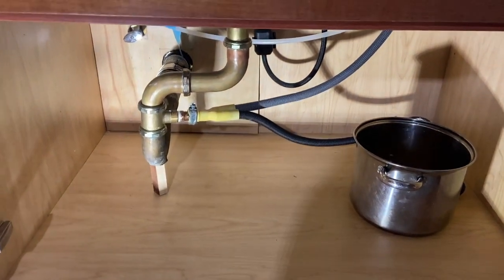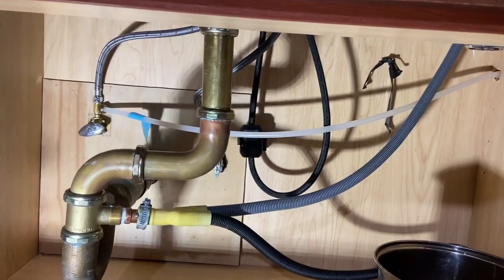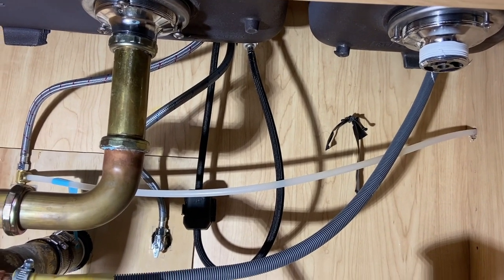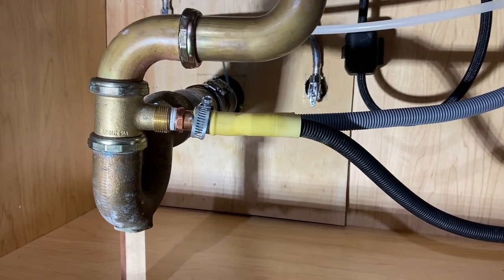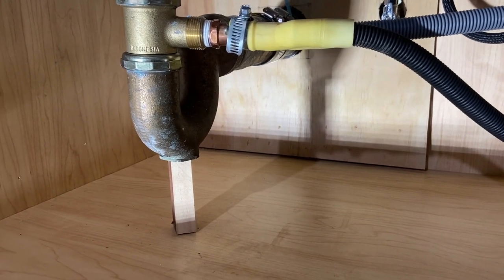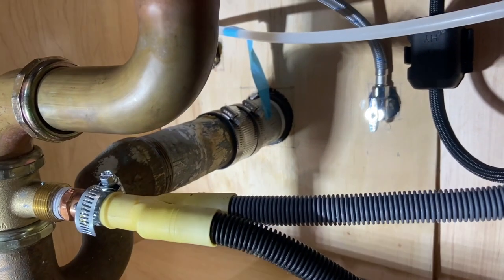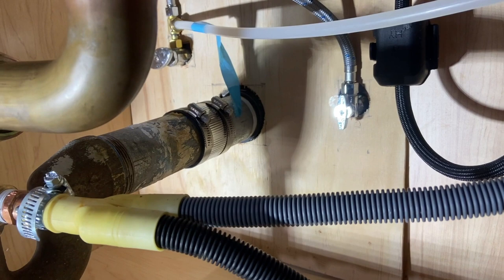And you can see he had a pot there in case somebody forgot about that right side sink. And I think somebody must have. But anyway, you can see here what a debacle this was. The way they supported the trap is ridiculous. And you can see coming out of the wall, there are a couple of galvanized nipples. They just stuck a nipple in the wall, and then another no-hub clamp and another nipple instead of, you know, using a proper piece. And I hate when these guys stick the threaded portion of a nipple into a no-hub coupling. That's just a big no-no.